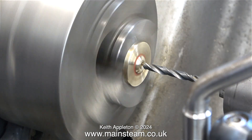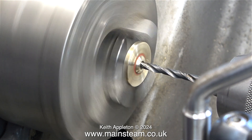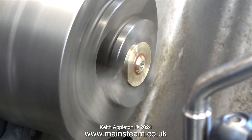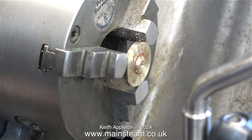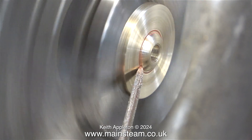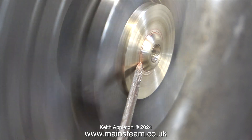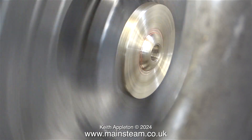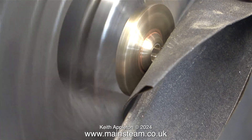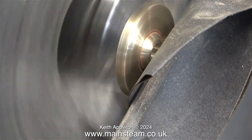I'm drilling the hole in the centre of the crank web 11/64ths of an inch, which is one imperial drill size less than 3/16. After this part of the job was complete, I cleaned off the red line that was left on the crank web using the point of a needle file, and gave the back of the crank web a bit of a polish using some wet-to-dry sandpaper — this is 400 grade.